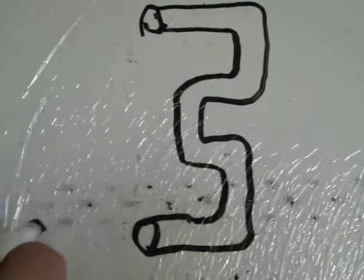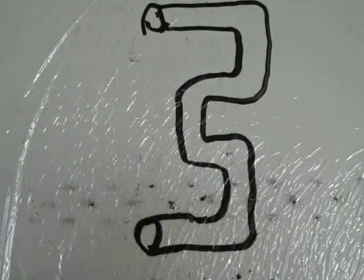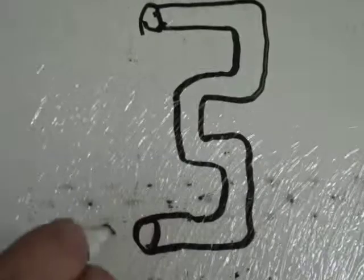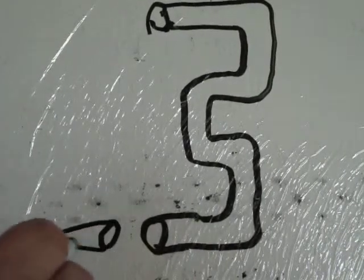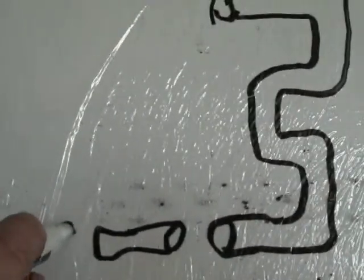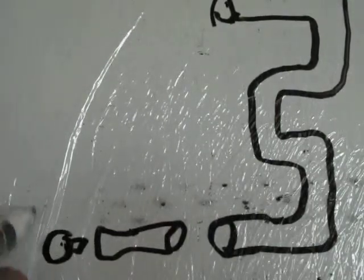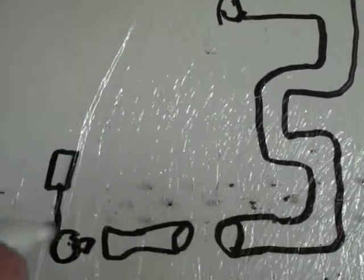Thanks. Okay, so we have a bent tube heat exchanger. Instead of a ribbon burner, a long burner like what we had before, we now have what is called an in-shot burner. The in-shot burner basically looks like a little Venturi. It has the gas train, just like what we had before, with an orifice and a gas valve. Let's put the gas valve here and connect it. That's a connection to the gas valve.